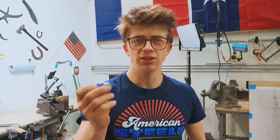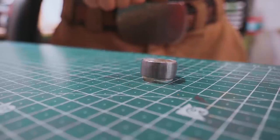Right now I've got a little difficulty planning out my order of operations because the steel needs to be hardened. We want to set a gem in it, but stone setting will probably need the steel to be soft — and I don't want to etch it with the silver mounted. So I have to harden it, polish it, etch it, somehow do the stone setting and the silver without being able to move the steel, because hardened steel is not going to move. I'm going to have to start somewhere and I think I know where.